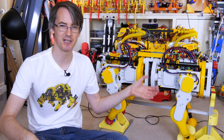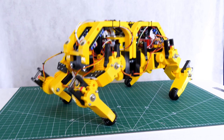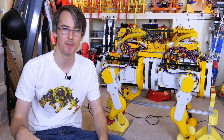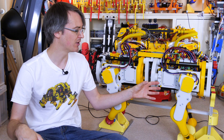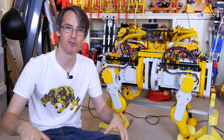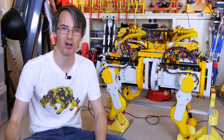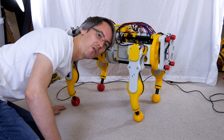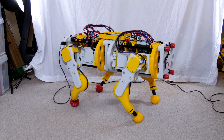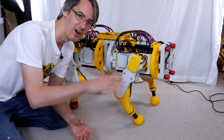The next thing I'd normally do is build the kinematic model so we can move the robot in three axes of translation and three axes of rotation — that allows us to position the feet in XYZ Cartesian coordinates and solve all the motor and joint positions to keep all the feet in sync. However, I'm not going to do that just yet. Right now I'm just feeding positions over serial via a USB cable, but I can't type positions quickly enough to jump, bend the legs, and test compliance, so I'm just going to make some timers to feed fixed positions. The first test is a little jump with fixed timers and fixed positions to bend the legs, straighten them, jump back down, and support itself on the compliance of the bent leg.